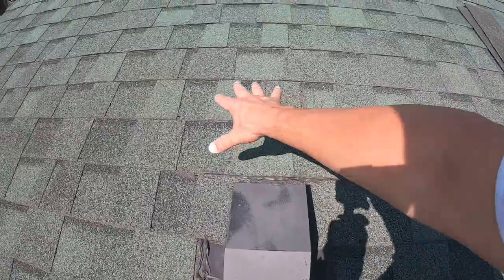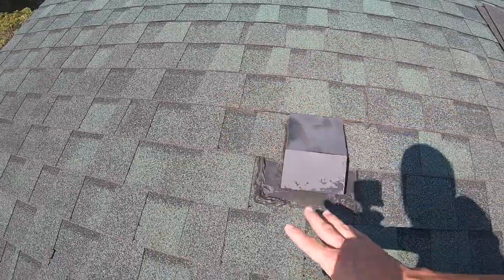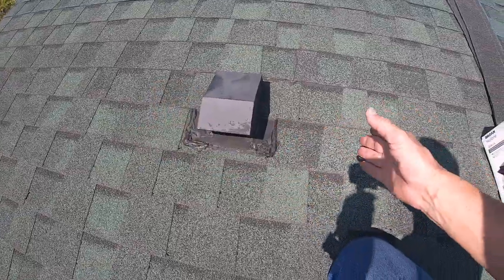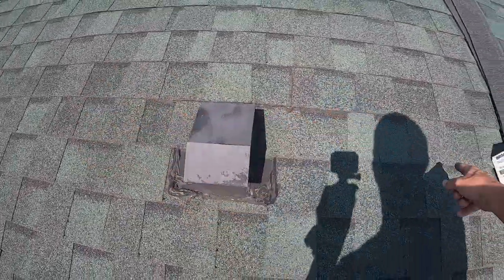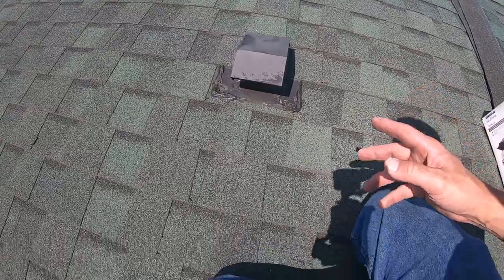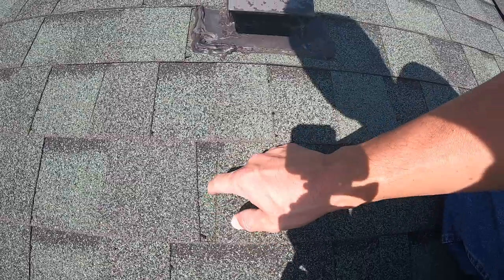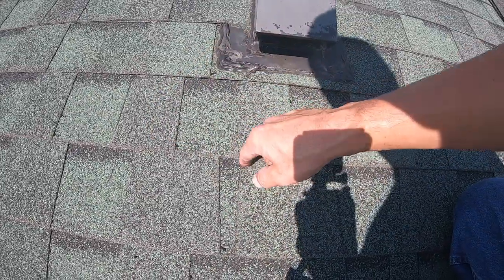Plan of attack: remove some shingles above the nails, flat bar around the pattern. If you want to take a whole shingle you can, but if there's a keyway right here you don't need to take both shingles — you can cut your pattern and stagger it out. Just keep a couple of key concepts in mind. Your keyway, where two shingles come together, you don't want two of these to be closer than four inches or so.